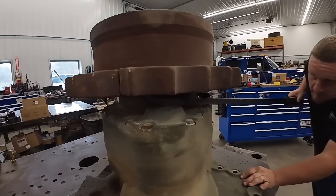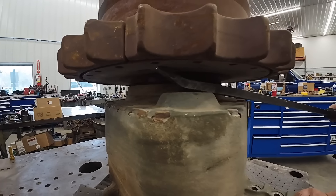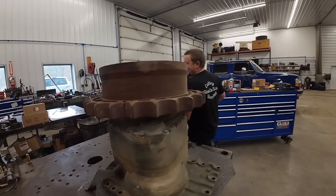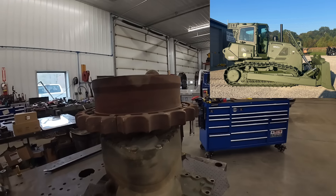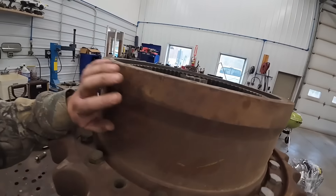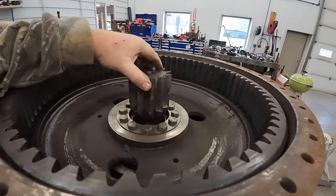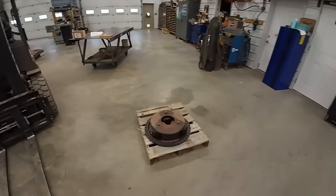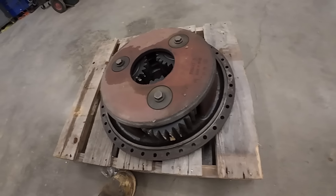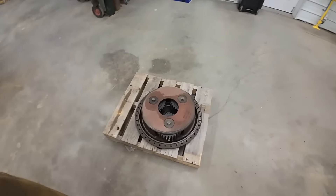This thing came in and Kevin's going to give it the wiggle test. What kind of tolerance is there? I don't think it's supposed to be a half inch — a couple thousandths. So that dozer was cannibalized. They took parts off of it and put new parts back on. So this is new sprockets, looks like a new outer ring gear housing. As you guys can see, it's pretty well trashed. This is the outer planetary — these are what they call the planet gears. They revolve around the sun shaft that's in the middle, but it's definitely torn up.